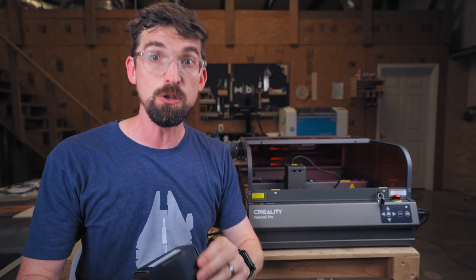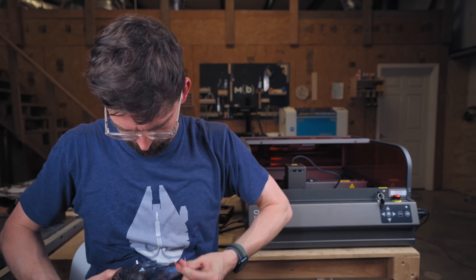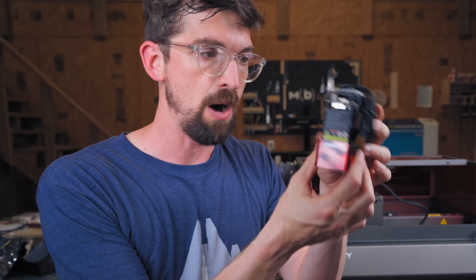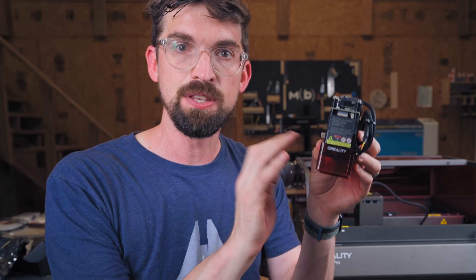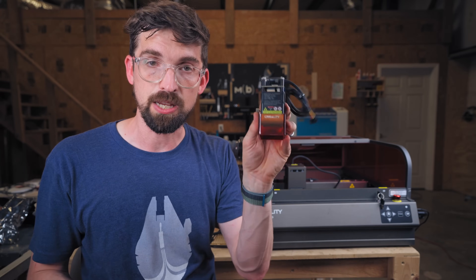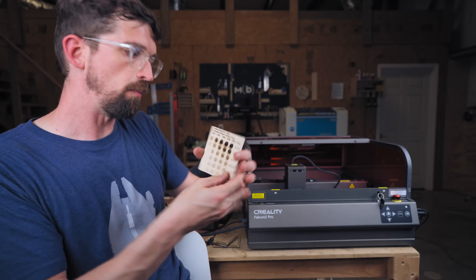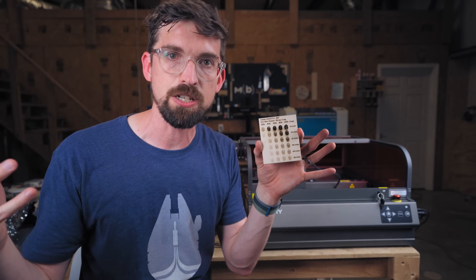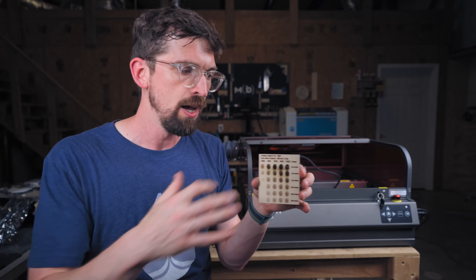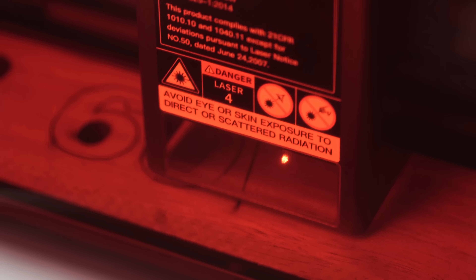One thing they've brought over from the 40 watt unit is a 1.6 watt laser module included in this box. This gives you a much finer laser dot even compared to the 22 watt, so if you want to do fine engraving, you just plug in the power — there's no air assist option for this one since you typically don't need it for engraving. What I like is that inside LightBurn I can have different layers set to different wattages: use 22 watts for fine text, then crank back to 60 watts to cut the whole thing out.